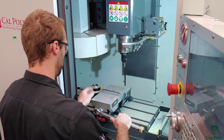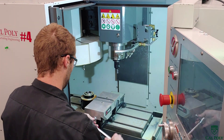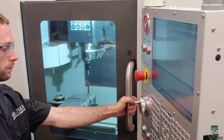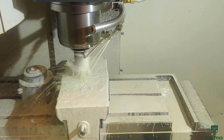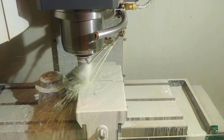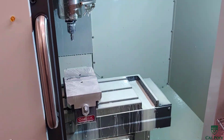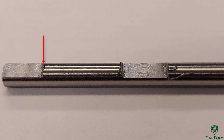After we hold it in the jaw, we use the torque wrench to tighten the jaw to a specific torque so we clamp the same amount of force on the part every single time. At that point we close the door, make sure the appropriate CNC program is loaded, and hit the green cycle start button. The 5/8" end mill comes down and slowly cuts the middle slot and then cuts the end slot where it's going to attach to the crank disk. Notice this video is sped up for your convenience. When we're all done, the table moves forward, we blow off the workpiece, and we unclamp the part. Be careful — there are still some burrs on this part from the milling process.